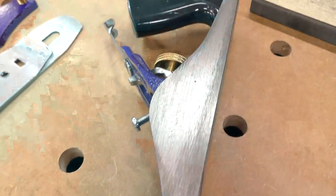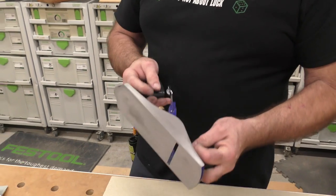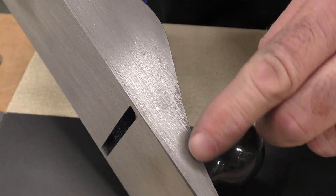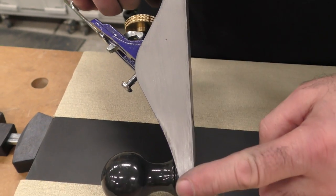There's going to be a little more work on there. In close inspection, you'll see those grinding marks — they must have ground this at 40 or 60 grit. You can see my 80-grit scratch pattern. This looks really good. From 80 we're going to lap through 120, then 220, and stop at 320.